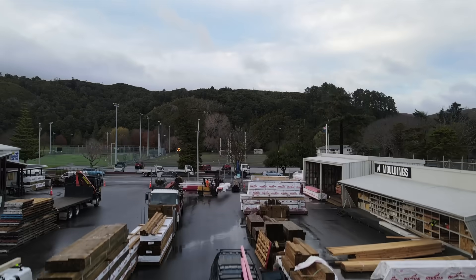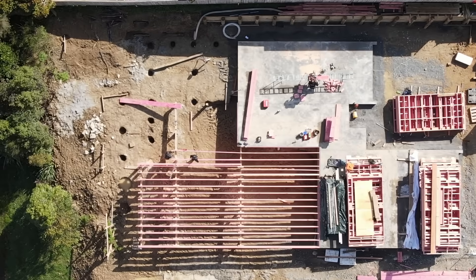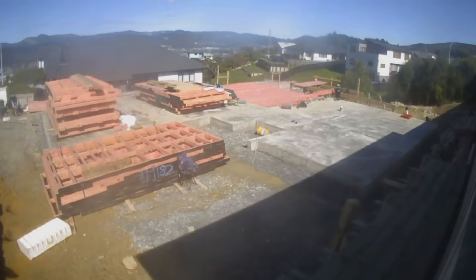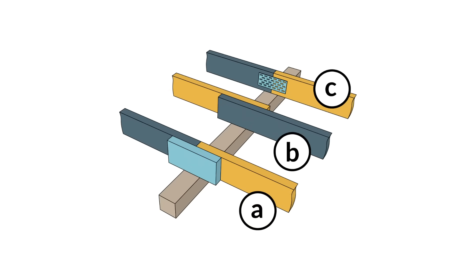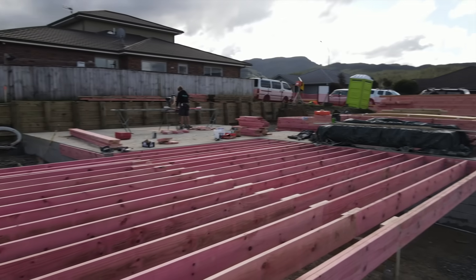When cutting your joists, always put the bows upwards. A top tip: eye up the timber at the merchant's yard before loading it on the trailer so you know you're bringing back top quality material. In an ideal world your joists would be long enough to do the full span, but if you need to join joists, there are three ways: a flitch plate, a lapped join, or a nail plate join.